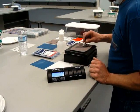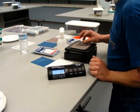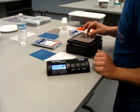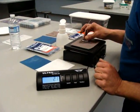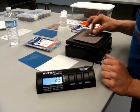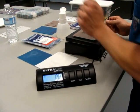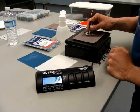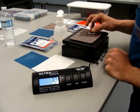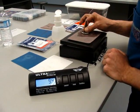Back to zero. It's just a test connector. The amount of pressure I'm applying is roughly two ounces. Go ahead and apply more on the scale so we know how to determine we don't put too much pressure on it. With this device, we can watch our new, fresh students so that they don't overpower the connector and mess up a polish.